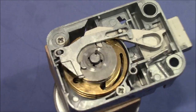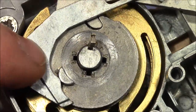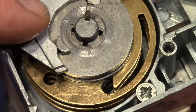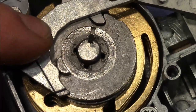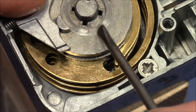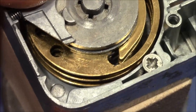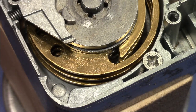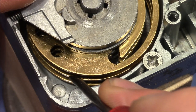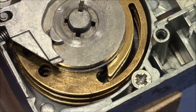There are four different options to connect them together — they are labeled — and why this is important and why we have four different options, I will explain in a minute. But now when I turn the dial, you can see I directly turn the drive cam, and the drive cam then turns the code wheel, and the code wheel then turns the next code wheel, and the next code wheel turns the code wheel on the very bottom. The very bottom code wheel is the first number that you dial in, the middle code wheel gets connected to the second number, and the last number is connected to the code wheel on the very top.